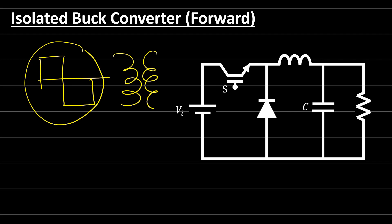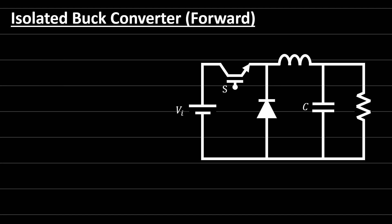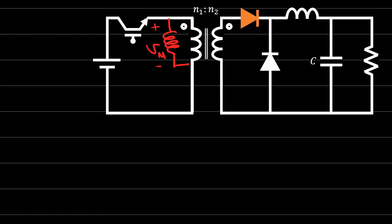In the buck converter things are a bit complicated and you cannot easily find the waveform that you can replace and install the transformer in its place. For example, we cannot install the transformer instead of the inductor, and we cannot remove the diode and add a transformer for isolation. It is enough to find a pulsating voltage at the output of the transistor, since what we need is a voltage change to make the transformer operate. But we also need to ensure that the flux within the transformer is balanced or reset to zero before the next switching cycle. Here is the traditional way of installing a transformer within the buck converter.